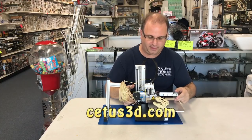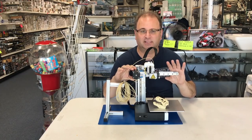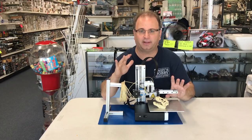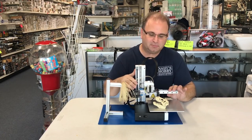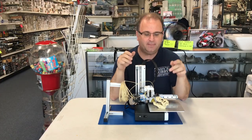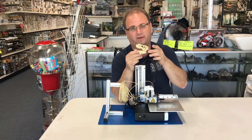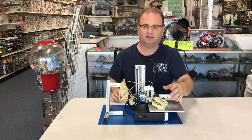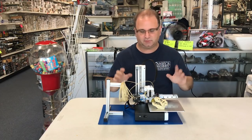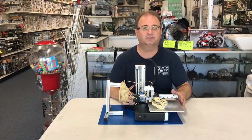A couple of things to point out if you do get one. When you turn off the 3D printer, the arm bar is kind of loose in the sense that it doesn't have the electric motor holding it up anymore. You don't want to bang it too much — it can fall down. Just push it down into a low position when you turn it off so you don't damage your print head. It does come with two other print heads — I've been printing with the 0.4 head. There's also a 0.6, which is a little bigger, and a 0.2, which is finer and will probably get even finer detail work. The 0.4 was already in the machine when I got it, so I just left it programmed and ready to go.